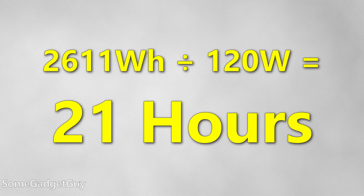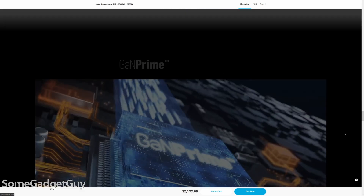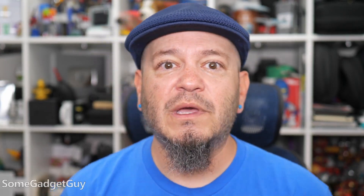That's really encouraging. Even under a worst-case scenario — if my fridge were running in the high cooling mode non-stop at 120 watts — I should still be able to keep it going for over 20 hours. These numbers are not exact, and I would highly caution you to make your estimates as conservative as possible. You don't want to crazy over-buy for a battery, but it's always better to end up with slightly better performance than your estimates. That should help take some of the sting off the eventual degradation as battery cells age. In an emergency, you don't want less actual runtime because you were banking on best conditions.